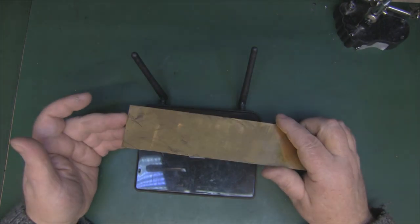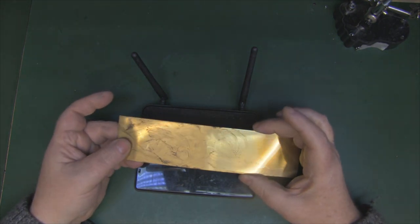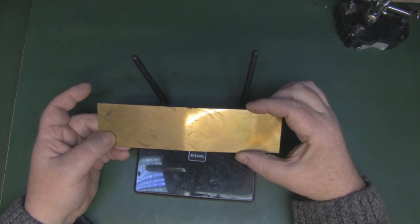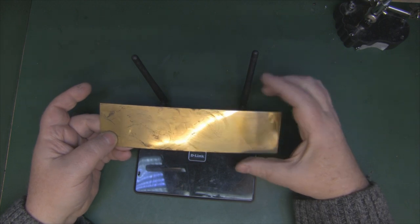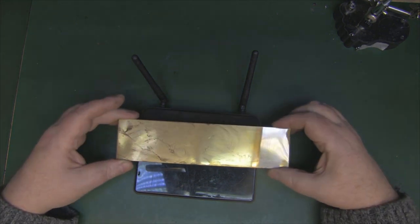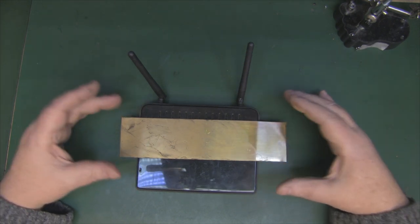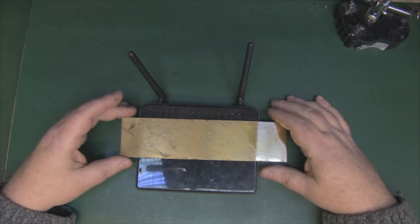This is a millimetre-thick brass and it's 50 millimetres wide, which is probably about the right width for a small dipole like this. You could go slightly under but I wouldn't go less than 40 millimetres wide; you can also go up — certainly 80 millimetres wide will probably get a little bit more gain. This is just a nice size for this mod, and it's really a straightforward mod you could typically do in a couple of hours in the afternoon.